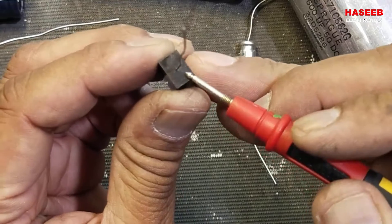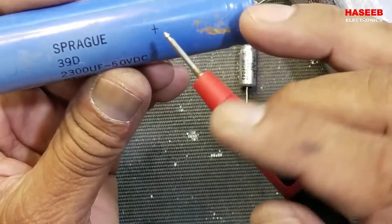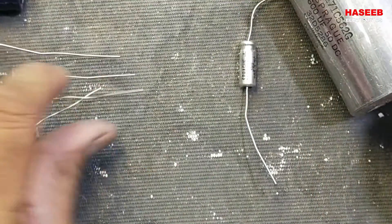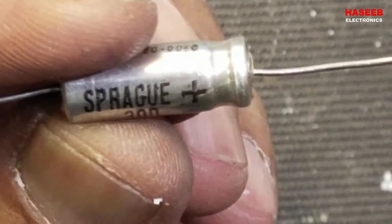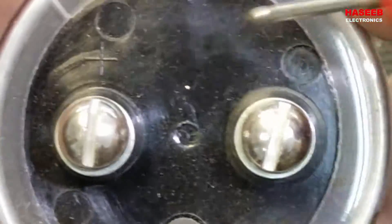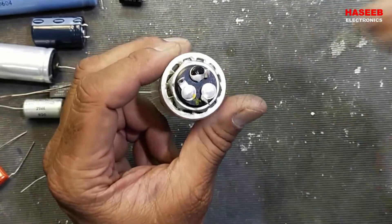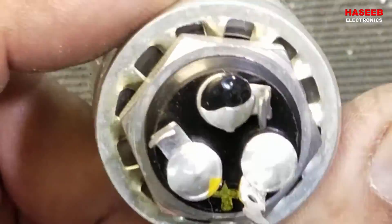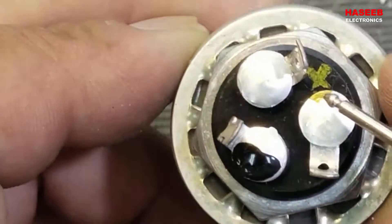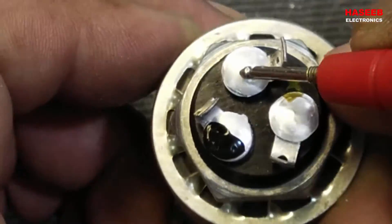This capacitor has a positive marking on the colored side, with the solid aluminum side being negative. Another capacitor has a plastic body on one side and a yellow epoxy filling on the other — the yellow side is positive. If a capacitor has positive or negative marking, it is polarized. We also have double capacitors with a common black lead that is negative, and two positive leads marked with yellow and a positive sign.